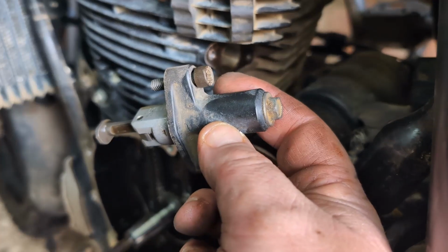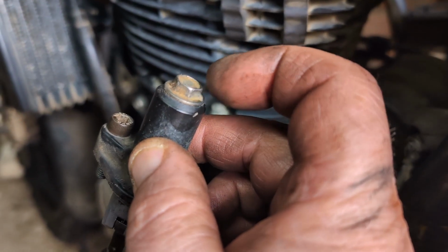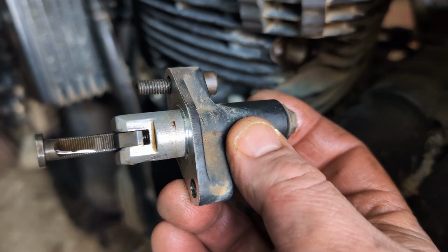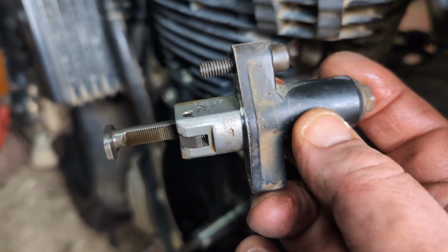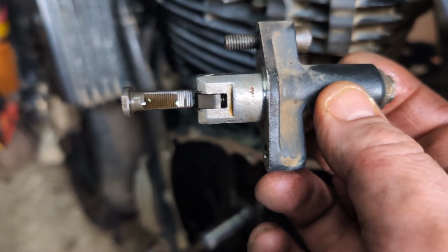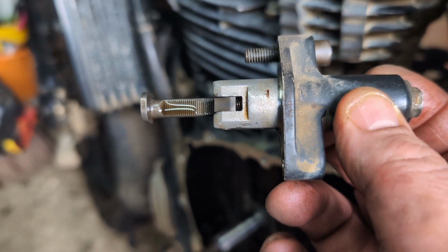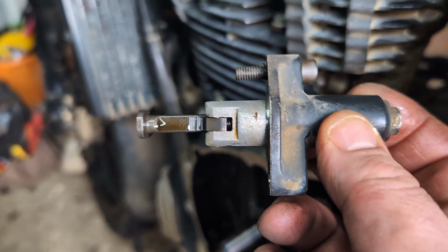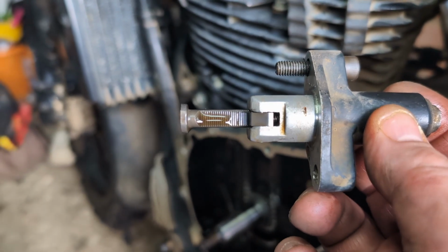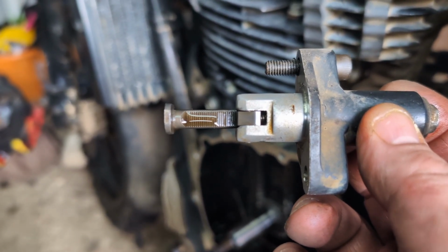We've taken the cam chain tensioner out. Before we fit it, we'll reset it. We'll undo this tension bolt, which will retract the spring, and then we'll reset this. But I'll also check to see exactly how far the plunger is out. As it is at the moment, that's exactly set to how it was. What happens there is that plunger at the end, when the chain gets very warm, will be at its maximum extension.